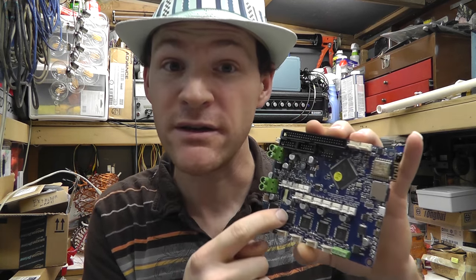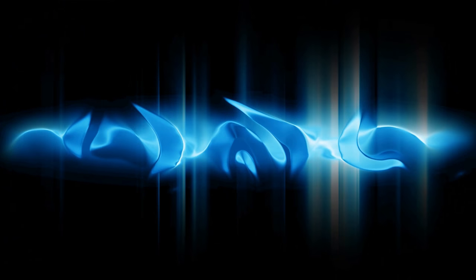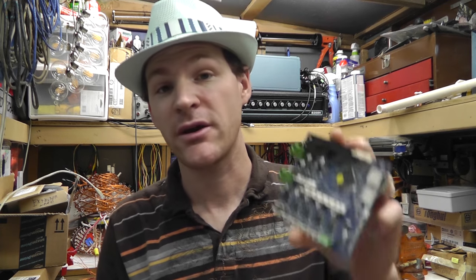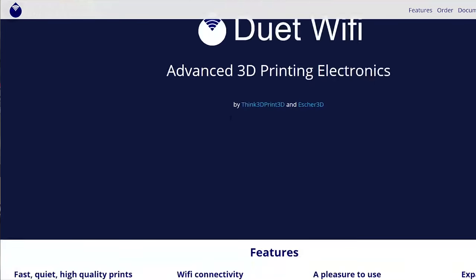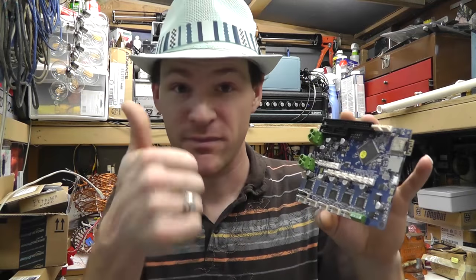The drivers will do 256 micro-stepping — that was really the key component. So my first impressions on this board: the first thing I want to talk about are the motor drivers. The original Duet 0.8.5 only has 16 micro-stepping drivers on it. That was a mistake in my purchase and I actually thought it was higher. So I'm very happy about that. These chips are actually the TMC2660 and the short little testing I did with them — thumbs up so far.